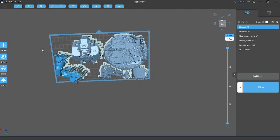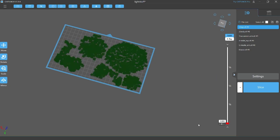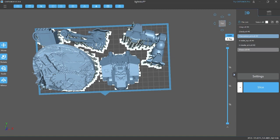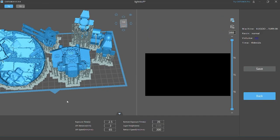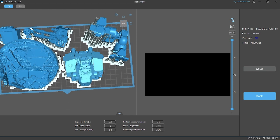Once everything is here, it's important to look at it top-down and make sure nothing is exceeding the edges. A lot of people like to look through the build to check for touching — I just keep it top-down and look at all the places where there could be contact. When everything is oriented on the build plate with nothing overlapping, go ahead and slice. Select it all so everything shows up in the preview on your printer. Notice how instantaneous the slice is now — these used to take five to twelve minutes.